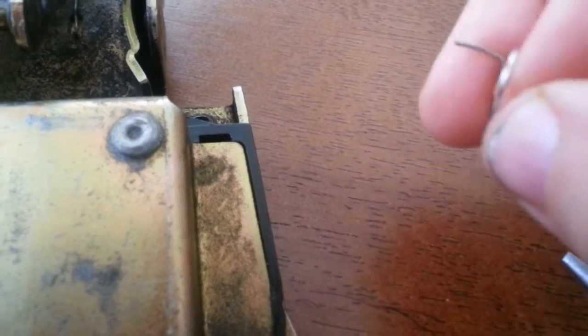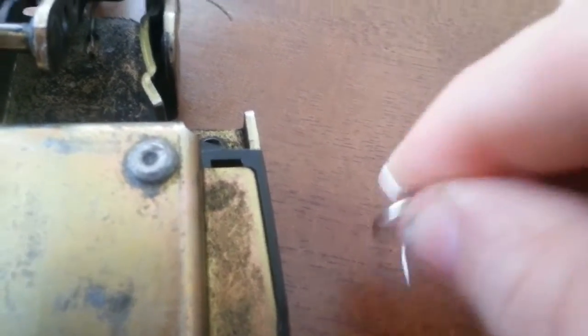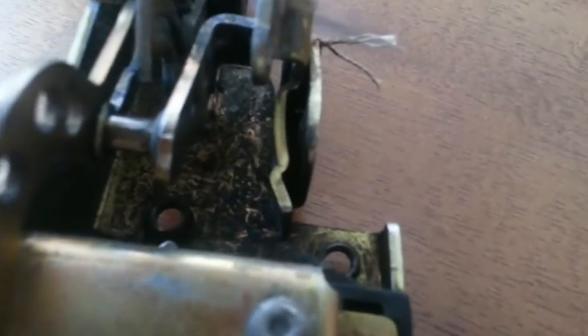Let's see if I can pinpoint it — just in there. So the spring will just drop straight in there without any fuss whatsoever, in that gap there. The gap for the middle circle is 8mm, and the ends should be 5mm, so I'm expecting to adjust this a little bit. I just wanted to show you where you need to put this, because I've seen the tutorials and you may be wondering where the actual spring fits — well, this might actually help.